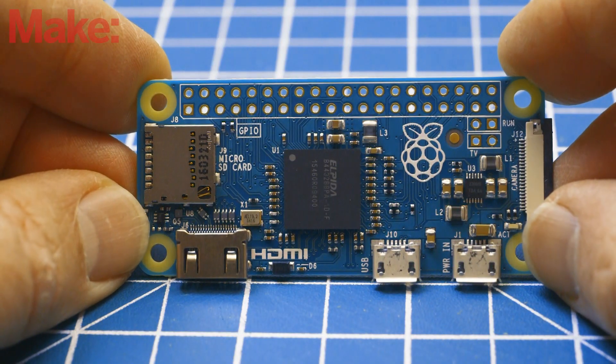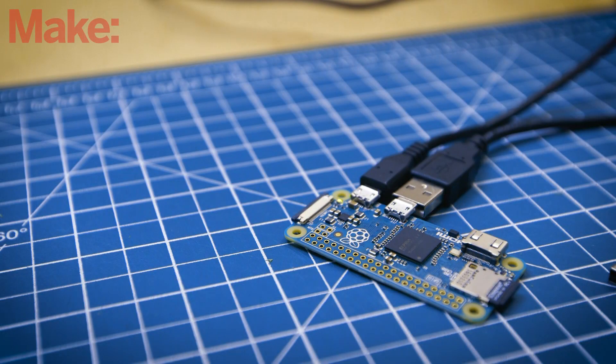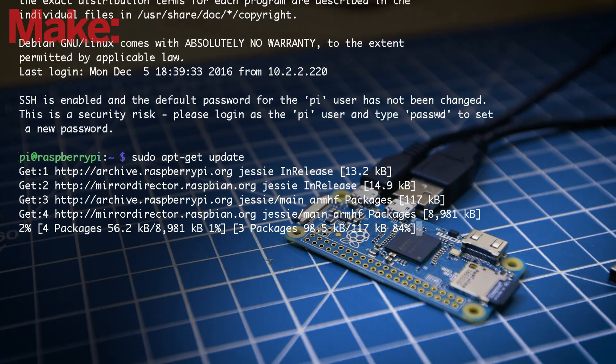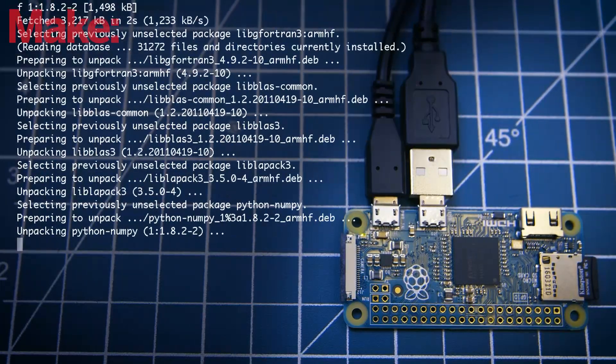For this project we'll be using the Raspberry Pi Zero with the camera module. Download Raspbian and then flash it onto an SD card, and then connect it to your network to power it up. Open a terminal window to the Pi and update the operating system. With the updates in place, install Pi Camera, Graphics Magick, and Git Core, and then clone the Git repo for the Pixi camera.